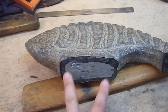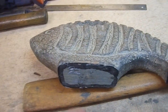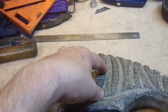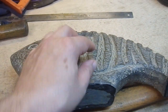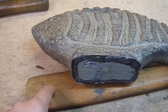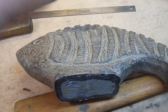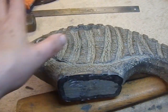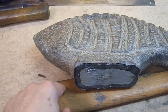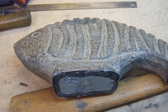I'm going to use two-part epoxy as well as a single wood screw. I'll drill a pilot hole through this after I get it in there. Once I get it epoxied in place, I'll put the epoxy in, go right through it, and have the screw act as the clamp — so the whole thing will be held together with that. Let it dry and then we're finished. That's fairly straightforward, I think.